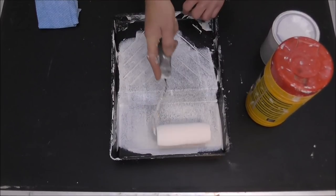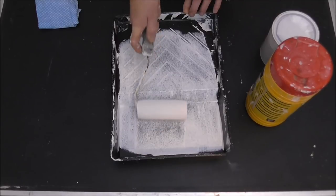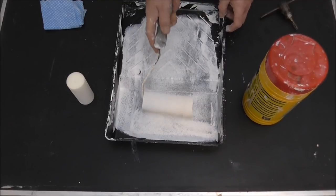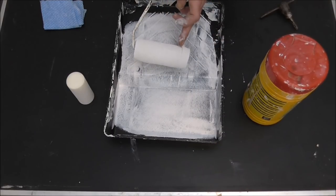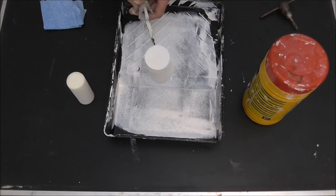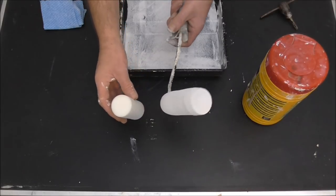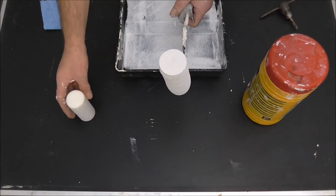With the old emulsion rollers, mini rollers, you can pop them in there and they'll last. I've been working that for a bit now, and when you're working up to corners and things, you'll notice after a while that they start to tear. That is literally just the edge of the roller cutting through. So you can see there now the difference in them. Move this out of the way. So these things will soon fail on you. Better to use an old emulsion roller. Keep these for your oil paint.